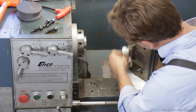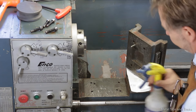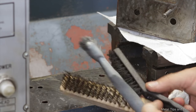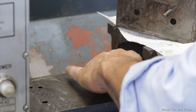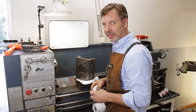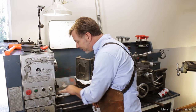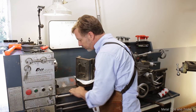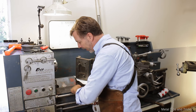What I did to clean this: I went in with paint thinner — I have a spray bottle of it — sprayed it down, went in with some different brushes. I also had a little paint scraper to just work everything. Because remember, this originally was painted in place, actually bondoed into place, and then painted. So there was a little area where the bondo was sticking up, and we want to get rid of that.